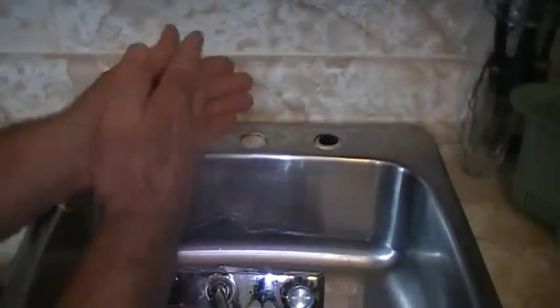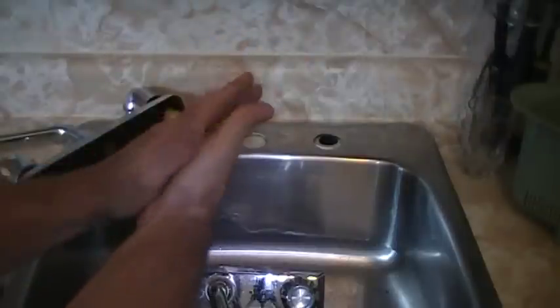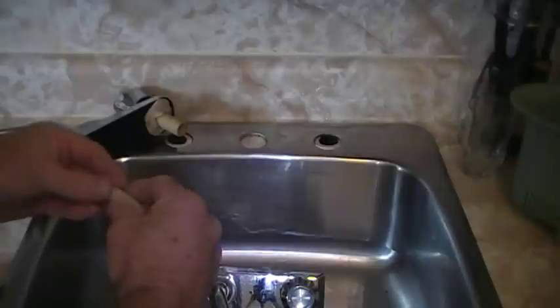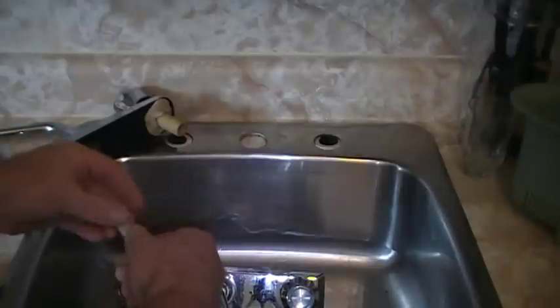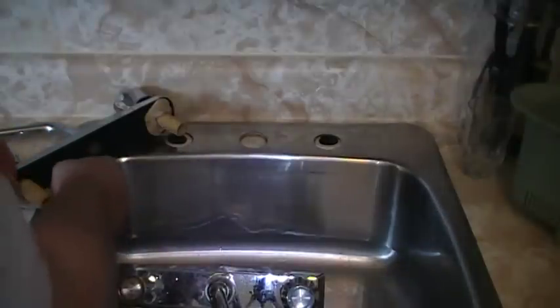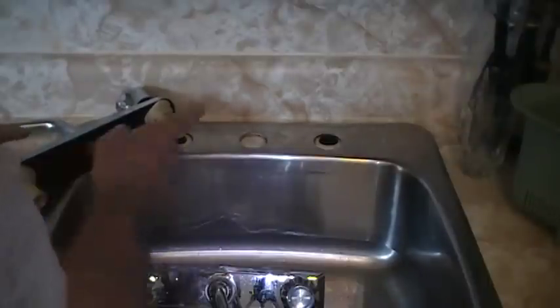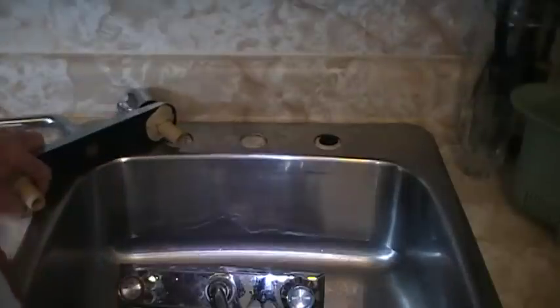Just take a little of it like so, roll it like that, take it and wind it around the faucet. What that does is prevent water from going down and destroying the countertop. I've seen numerous times where people have installed faucets and a year later the faucets are loose again, because the water has gotten down there and it's only pressboard that the countertop is made out of.